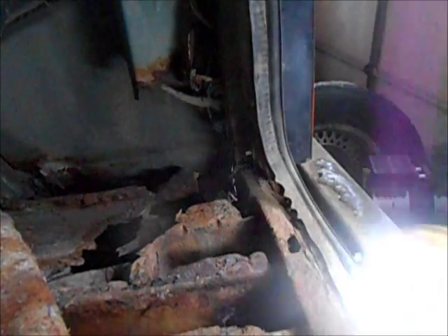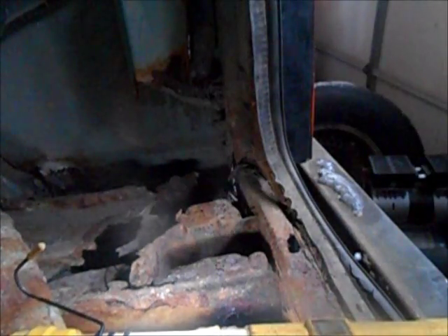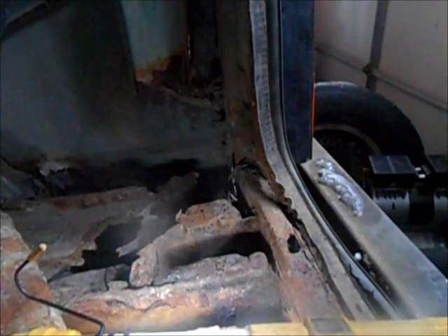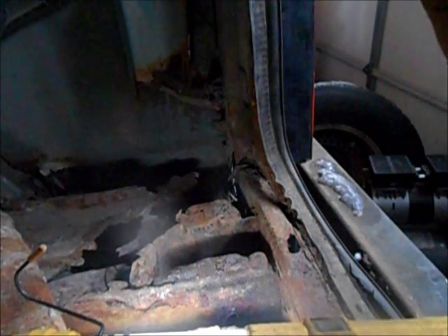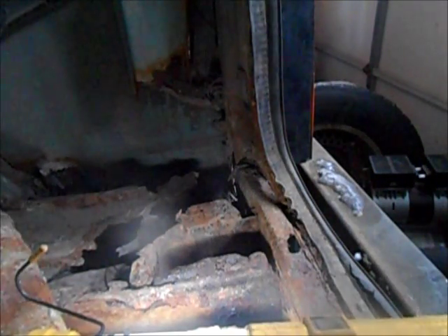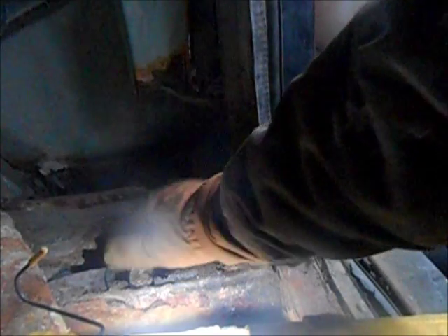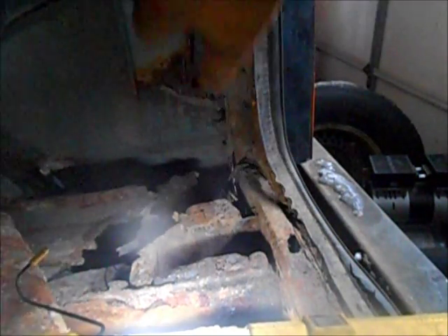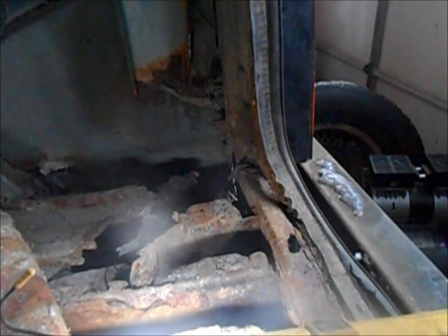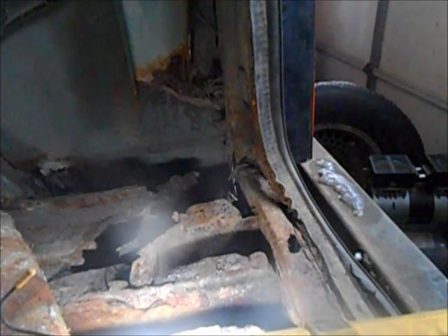The back, however — as I was jacking up the vehicle, if you can see right here, this wants to move a good quarter of an inch. Since the Jeep is jacked up resting on the frame rails in front of the spring mounts, the whole back end is sagging. My rear hatch, which usually fights me like a bugger to get open, is opening and closing like new. I'm thinking it's been like this for quite a while. So I've got to reinforce this spring mount — put that 3/16 plate in there, and I'm going to have to fabricate something. I had some 16-gauge steel which will probably work pretty well for that, to get it all tied back into the unibody.